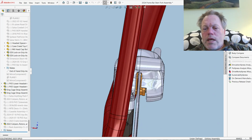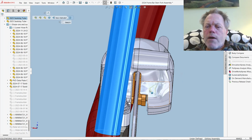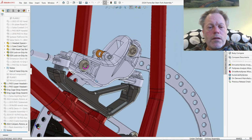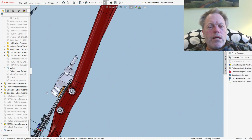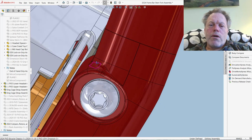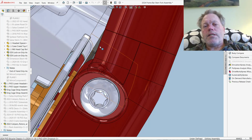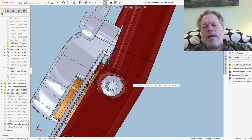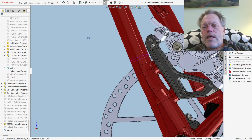So I could probably come in closer with these seat stays to that 180 rotor, but the caliper's not aligned. Down here, when we look at the 180 rotor, we're coming pretty darn close with our chainstay as it is. Now I could extend and go around, but I still can't get much narrower than how I am over here. So we're pretty restricted there.